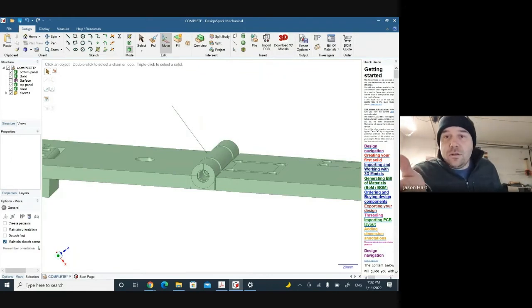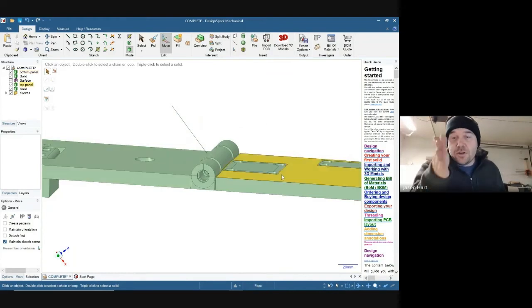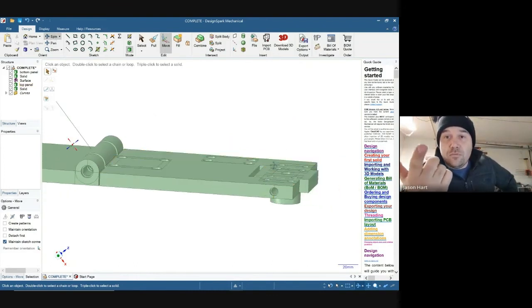And then you would also gain a lot in rigidity by having your layer lines basically aligned. I think about it like wood grain. If you were to print it standing up like that, your circles would be perfectly round. And also your layer lines would give you a lot of added rigidity from it wanting to bow or anything like that. The disadvantage, of course, is that you have to add supports for the upper right.